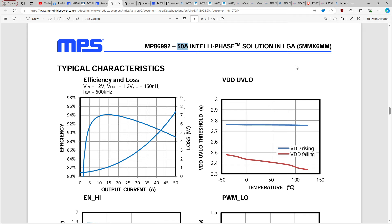There was a Biostar board I tested with 90 amp ISL99390 power stages that ran stupid hot because it was a four-layer PCB — the PCB was making more heat than the entire VRM. Gigabyte pulled off basically the same thing with a Z590 board where the power plane was literally running hotter than the power stages, because the board was six layers and the 11900K is one very thirsty CPU.